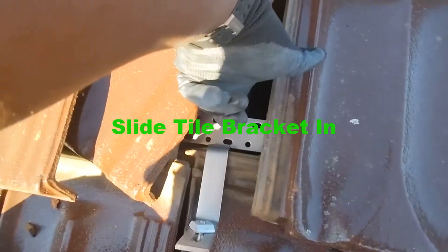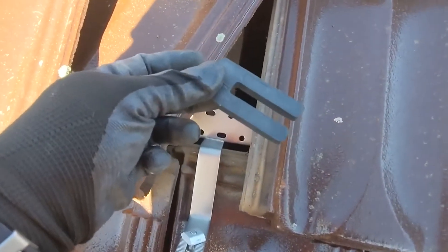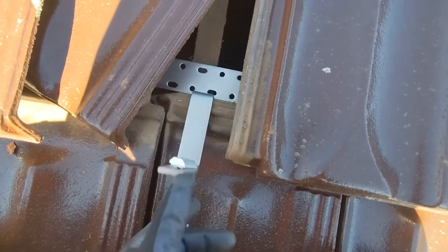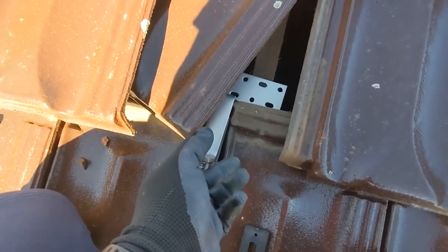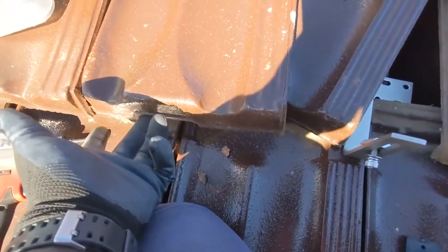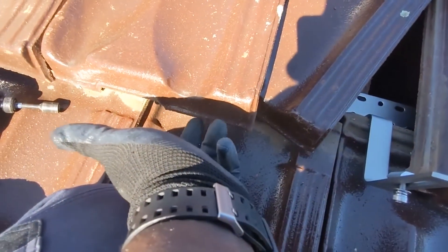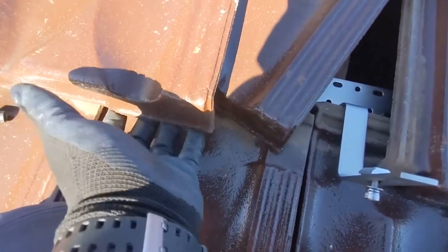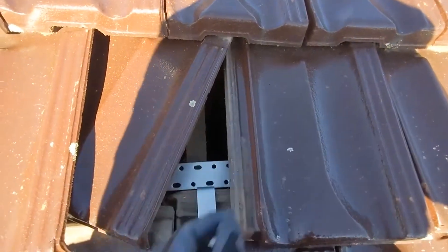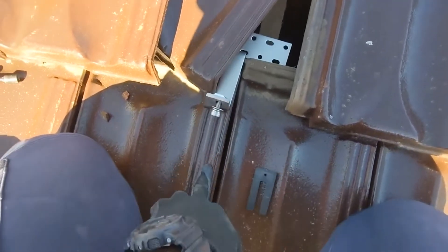As I was telling you, I don't know if you can see the space in between there — that's where the spacers go in. Usually you don't put the spacer at the front here. Try to put it further back so that it's easier to chip it out if the tile doesn't sit properly. Some people put it at the front and it's going to interfere with the tile, and that's where water might go in through that area. So not here, but here, exactly where it's aligning with the timber.